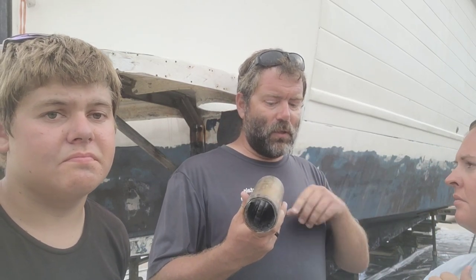Will those just wear out because it's rubber just sitting? You know, you wouldn't think they would because there's nothing turning. Yeah. I would think it's the turning of it that would wear it, right? Because there's your props running. But it's not exposed to sun, so you wouldn't have the rubber failing. Oh, like from UV and stuff? Well, yeah. Just growth. But basically, the way you check that is you grab the end of your propeller and you kind of lift it up with your shoulder when it's out of the water. And if you can get any movement, if it jiggles at all like this, it's time to replace it.